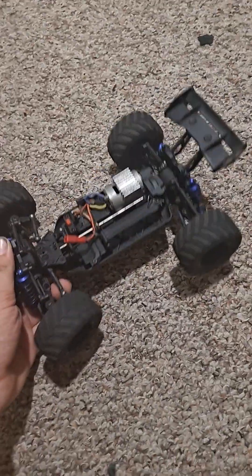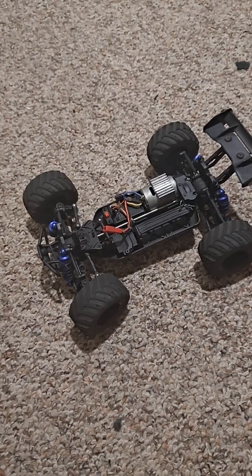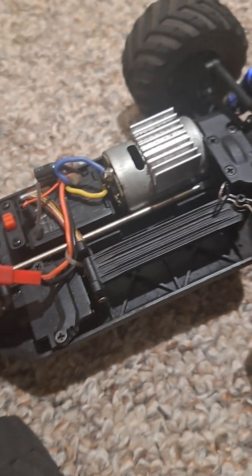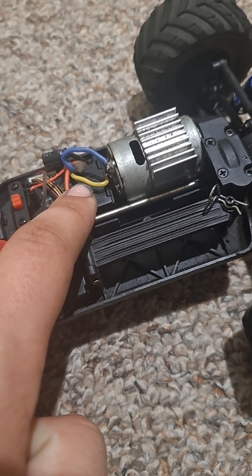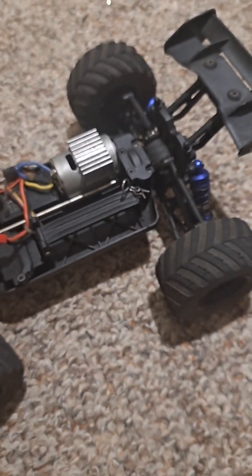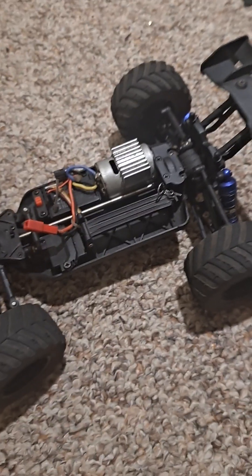Onto the main chassis — I never had that many issues with the chassis. The only problem I had was I had to replace the motor, because it's a brushed motor and they can burn themselves out. This doesn't have any motor connectors, so if you want to change the motor you've got to desolder the plug. There's a yellow one for negative and positive. That's the one bad design. I don't have a soldering iron yet but I probably will get one.